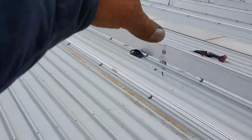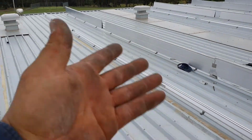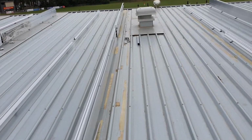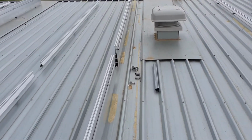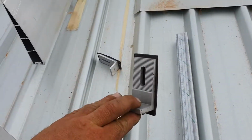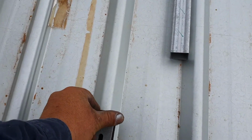Because normally I run underneath it, because Rapid SML means I can adjust the height, get everything perfectly level, and leave a gap to run that steel underneath. And when I run that steel underneath, normally I put it in a bracket like this, which is a standard Chinese racking tin foot there. Put a bit of neoprene on it, put that in a tech screw. That goes across like that.